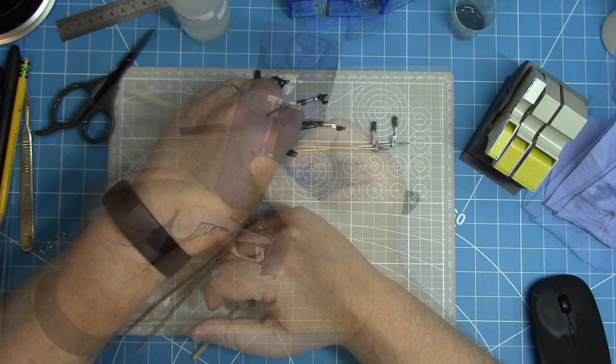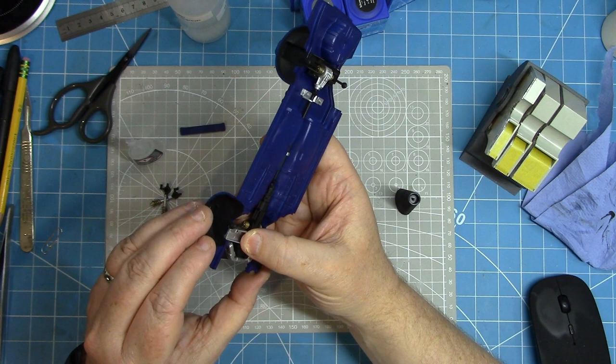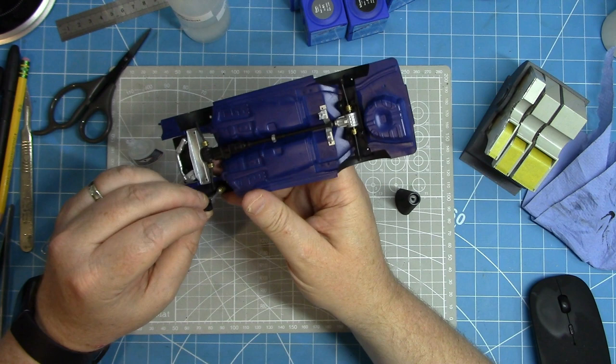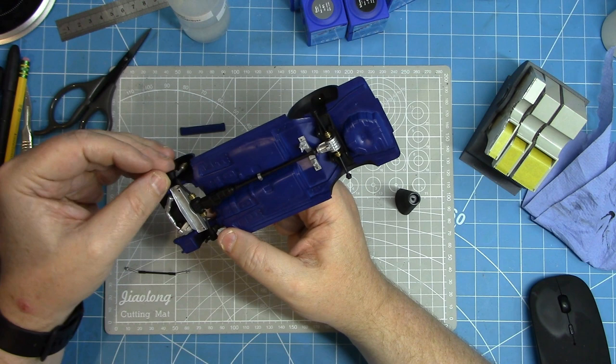So with all those parts painted, we start adding components to the front subframe. So there's a main cross support. Once that's in place, can add in the individual suspension struts. So the ones for the front are quite obvious because they've got the additional parts which will allow the steering to operate. So it's the steering rack which runs across both those parts. So there's a separate little stub for those to attach to.